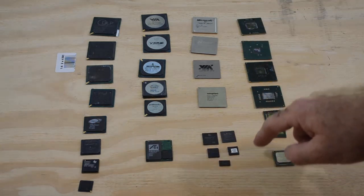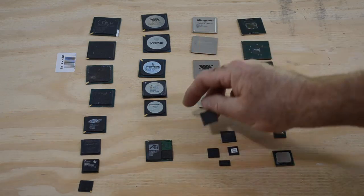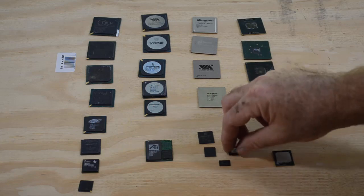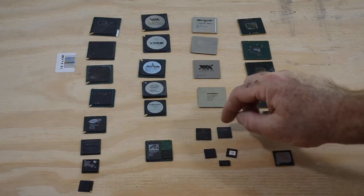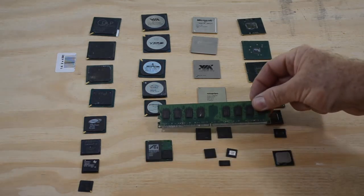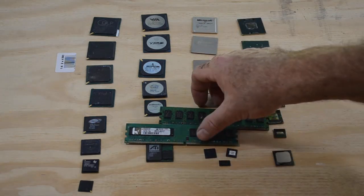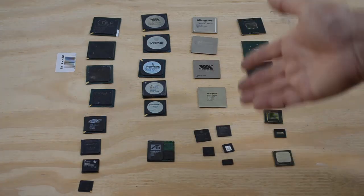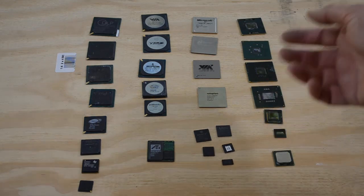Down here we've got some small BGA chips that don't really have a separate fiberglass backing — it's kind of internal, and you can't really peel it off. You'll see a lot of these big square ones on lots of equipment, and these smaller square and rectangular ones you'll see on RAM sticks — so these are probably RAM chips. You can't really do anything with them pre-processing wise; you can just go ahead and incinerate or wet ash these. I prefer incineration — just get the gold bond wires out of the ashes. That's probably your best way to go.